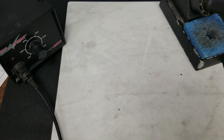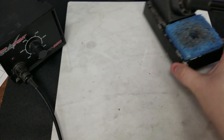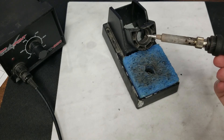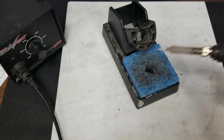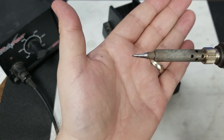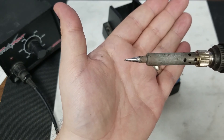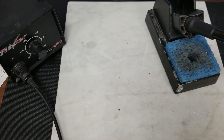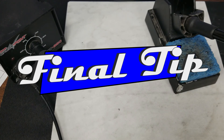A word on soldering iron maintenance: on my soldering iron holder there's a damp sponge. Take your soldering iron and do some gentle wipes, rotating as you pull, just enough to get the tip clean. If you put your soldering iron away dirty or leave solder on it, the solder will start degrading the tip. Always clean your tip before powering off. And as always — practice makes perfect. You have to practice, damage things, and replace connectors, but you can do it. Just start soldering and you'll pick it up.